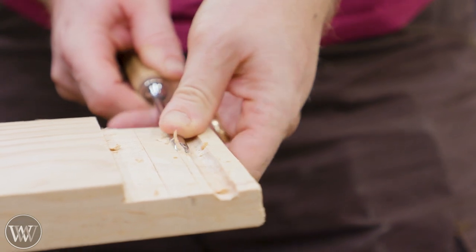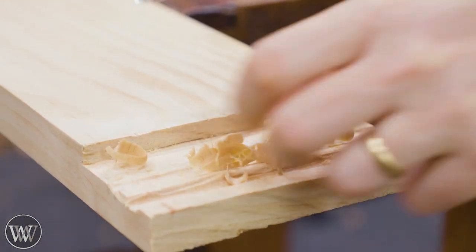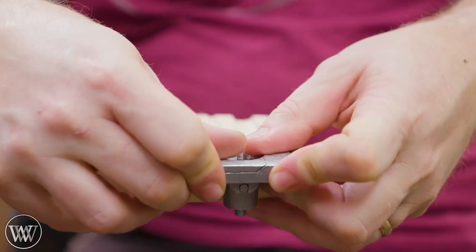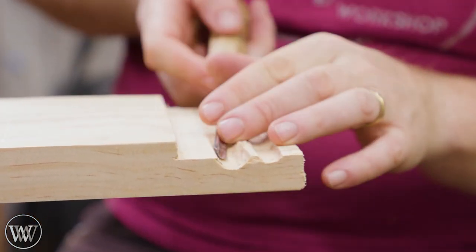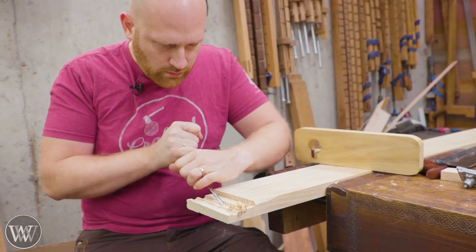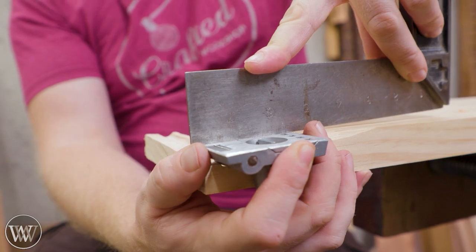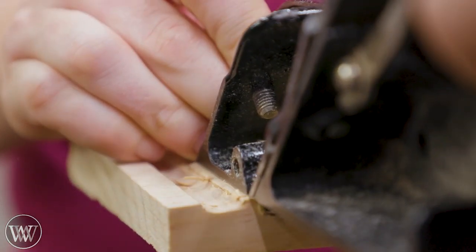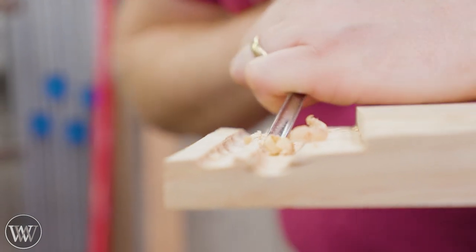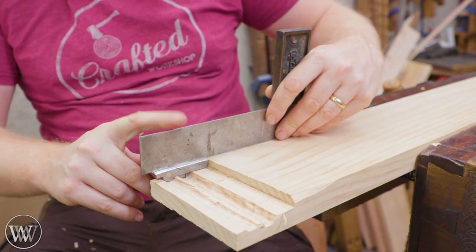This one needed the edges rounded, so I flipped the gouge over and used it to round the edge just a little bit. Then I started working on the second groove — this one needs two gouges. You really don't need to make two gouges; the second one you could cut out small rabbets beside the big circle hole. But since I've got the gouge out, might as well do it. It goes really quickly and it's good practice. Make sure it goes down deep enough so that it won't stick above the top. I needed to do a little more rabbet planing and then gouge out a bit more to get it down to depth. When you put the depth stop in, it will leave marks where you need to remove more material.